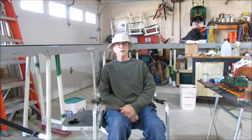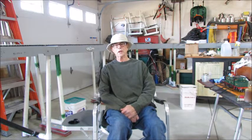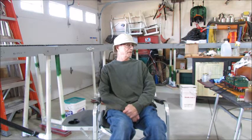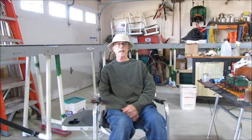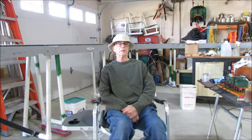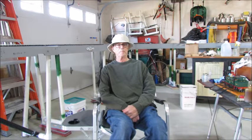An interesting thing about the ARMIG is that it requires a very large radius as originally designed. It would not negotiate an 8-foot curve, but did require probably a 10 or 12-foot radius curve. This engine is highly modified so that the front axle has a lot of swing. The rear truck was moved forward about 3/4 of an inch. In addition, the rear truck axle had to be removed to make room for the burner, as this engine is an alcohol-fired engine.